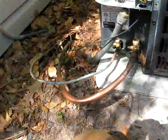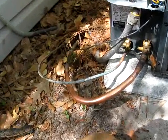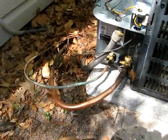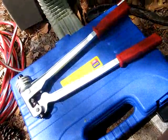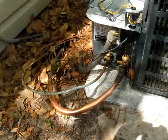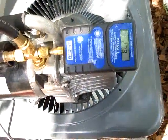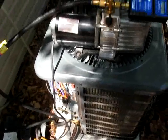We have a new piece of copper fitted up here. Took a piece of three-quarter inch and used the ratcheting benders to put an arc on it the way it should have been done the first time. I did buy those expanders that Yellow Jacket made — I was probably the last person using swages and a hammer to swage copper — so I wanted to join every other person in the HVAC trade by buying that. I'm going to go ahead and braze this up, then test it with nitrogen, then put it into a vacuum. Our vacuum's at 283 microns, it's been running for about four minutes or so. That's a benefit to working quickly — the line set isn't open to the air very long so the vacuum will be a little faster. I'm going to let it roll while I'm cleaning up, then insulate that line and get this thing started again.